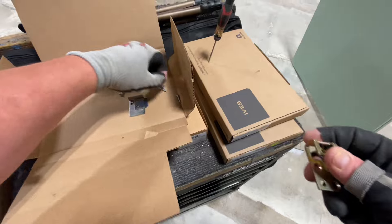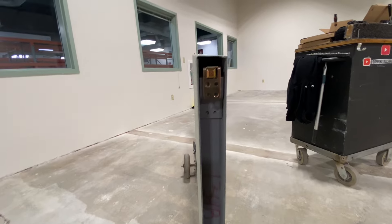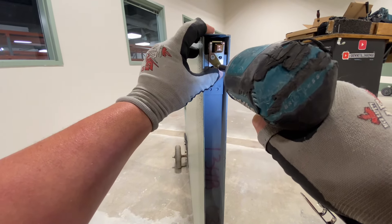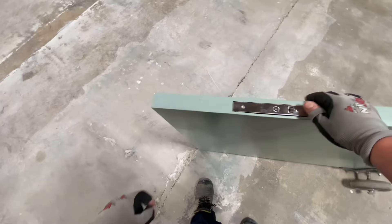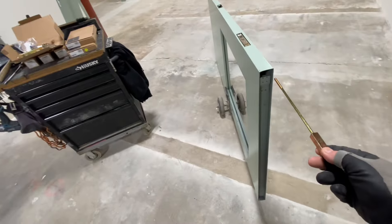You've got a double keeper here, and it's always nice when the screw holes at the top and bottom of the door are prepped - sometimes they're not. There are two countersunk holes in that double keeper plate that you put the screws into. Boom - your bottom flush bolt is installed! Congratulations. Let's go do it to the top - don't savor that victory too long, we've got work to do.